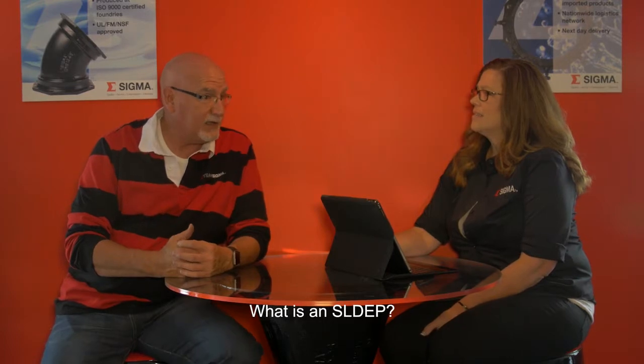Well, what's an SLDEP? An SLDEP is a packaged unit of all the things necessary, including the gland, to make the connection. The T-bolts, the nuts, the gaskets, as well as the restraint gland itself.